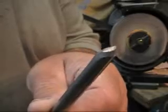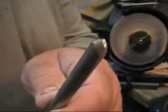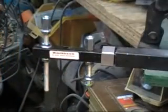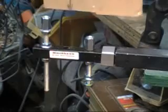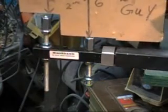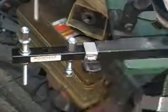This is a double bevel grind by Ellie Avacera, and I made a special rig to sharpen that grind. You start with it in the back pocket, you put the tip on it, then you move it to the bottom one. The bottom one is 2 inches forward and 2 inches down. And I give you enough parts to do all that.